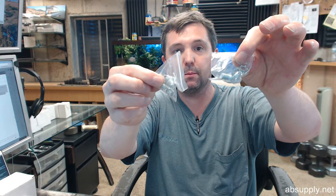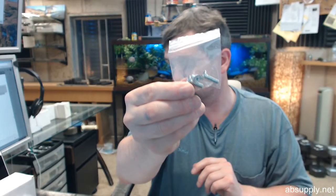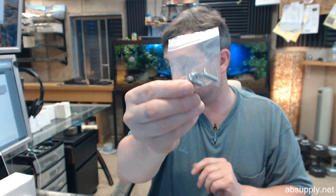Screws are included for your door portions, top and bottom — just typical hex cap screws. Screws are also included for attaching to the jamb. For the threshold, use the longer machine screws: get your threshold notched, fit it, countersink it, and secure it right down to the top of the pivot.